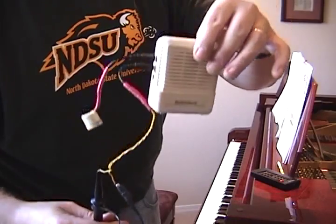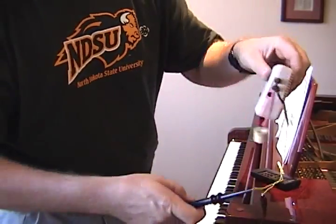So when I think a key is bad, when I think one's gone a little south or north, I get out my Tektronix oscilloscope, I hook this little rig up, and I can see in the fast Fourier transforms whether it went south or not, and I can take a tuning hammer and tweak it a little bit, and sure enough, bam, it's right on spec again until the piano technician comes back and does the whole piano again. I've got my little rig all set up. I'm going to put that down by the piano.